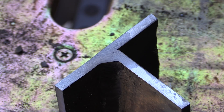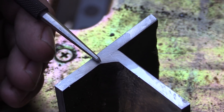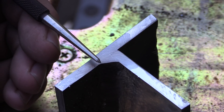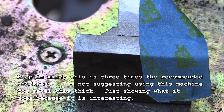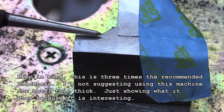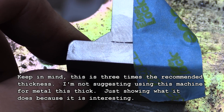Here's the cut and etch of the 3/16 material. You can see quite a bit less penetration than we had with the 1/8-inch, but we still are getting a little bit of penetration. Not too bad — I still have a nice flat weld profile, tied in at the toes, and we're getting a little bit of penetration. Here's the etch of the 3/8-inch material, and you can see far less penetration. Up on the top side it's going in a little bit, but on the bottom side it's just tied in — just barely. There's not a lot of penetration on this 3/8.